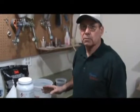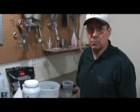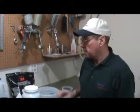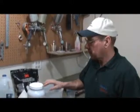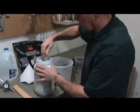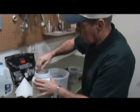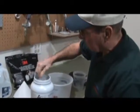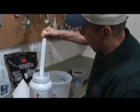We're ready to start mixing the paint. On this wing we're going to mix 50 ounces of primer and 5 ounces of distilled water — that's a 10 to 1 ratio. You need a little distilled water to make sure it goes on nice and smooth. Always stir your paint prior to pouring it out of the container so that anything settled to the bottom is in nice suspension.